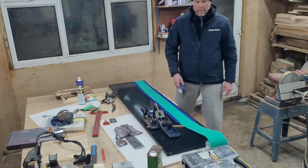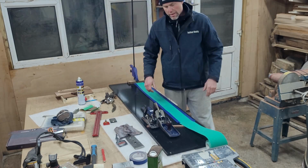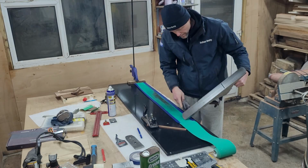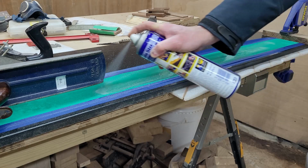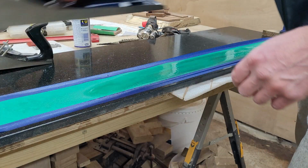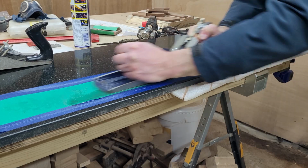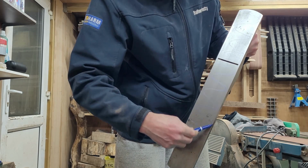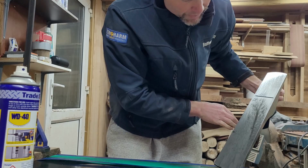It took me, I think, around 3 to 4 hours of using this grit 180, and probably after an hour or so I noticed that there is very little change, and gradually I went to 120, 80, and then when I was really frustrated I went down to even grit 60 to get it flat. And as you can see on the 180 grit, I used plenty of WD-40, in theory to keep the whole thing nicely lubricated and potentially introduce a little bit less moisture.